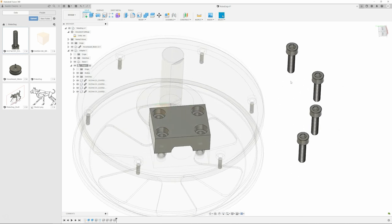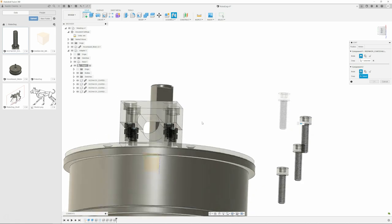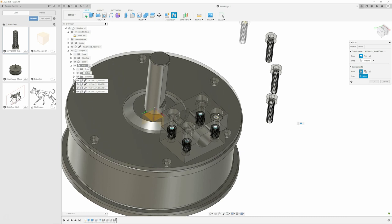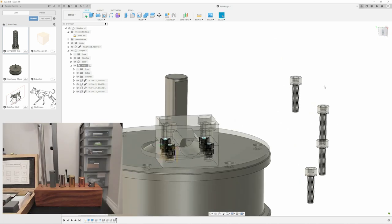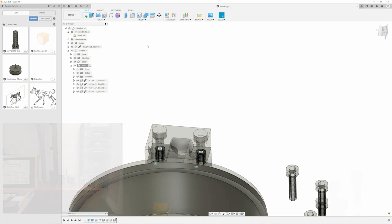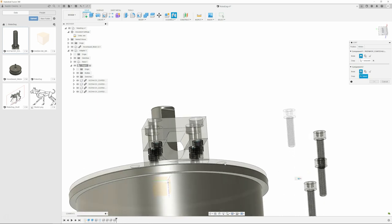On ABS I don't have as much experience, so you might actually see some shrinkage there. That's why I recommend first creating a small flat model where you can insert as many holes as you typically imagine yourself working with - Imperial and metric - then just print it out and see how it works. Keep screws with you: M1, M2, M3, and so on. Try doing this with different materials too, ABS and PLA. It's just a neat little tip especially if you know you're going to be messing around with hobby projects.